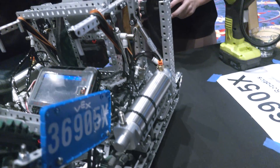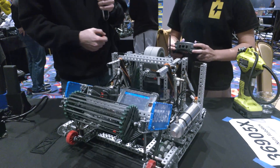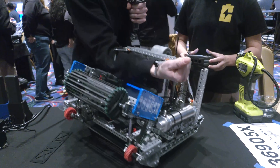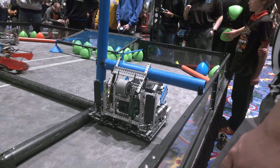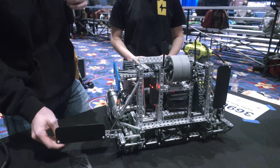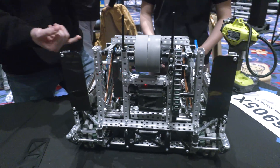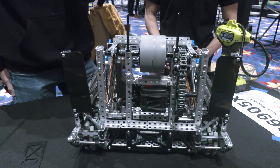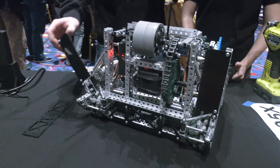Go ahead and retract those. And then we have our B-tier climb — go ahead and put that up. It's a nice B-tier climb with just two pistons and some rubber bands. Why go with separate pneumatic systems for each feature? In some matches we tend to use our wings a little more than others. It depends on what PSI we're at, and we need a certain PSI to get up to B-tier with only two pistons. With one accumulator tank, how many times can you deploy the wings in a match? Probably 20 or 30 times — not a lot of stroke on the cylinders. They're regulated down, so it's not using much air, which is pretty nice.